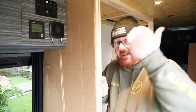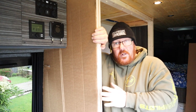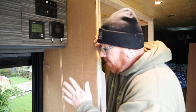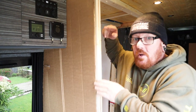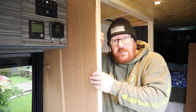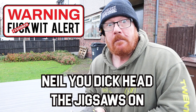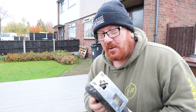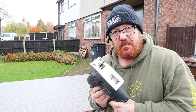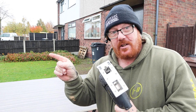We've cut the template out of cardboard for the back to get the curve on the inner edge, made the template, then transferred it over onto the furniture board. The front templates out of the furniture board go on first because that's going to be getting the screws from the inside - so we're not showing any screws but it needs to be done first. Now we've done the template, we've put it on the furniture board, marked it out, time to cut it with the jigsaw. We don't like cutting furniture boards because it's expensive and I have a habit of messing it up.